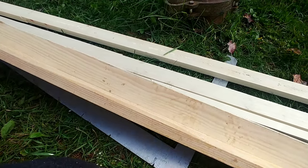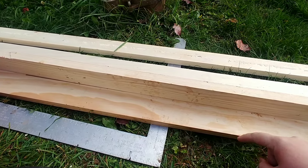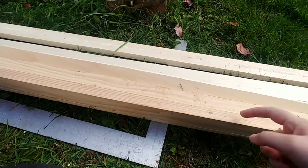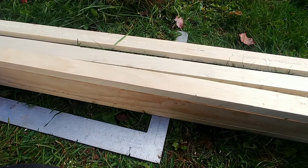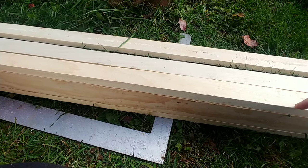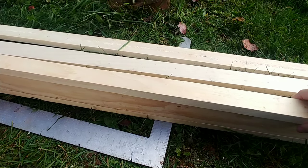So now I have the 1x3 or 1x4 on the back and then the 1x3 on the bottom — I've just screwed it in there. Now I'm going to put the lip on the front so that when we put the pictures on the ledge they won't fall off. I've got a 1x2 and I'm going to go around. Ideally I would use an air nailer so they're less visible, since I'm going in from the front to attach to the bottom.